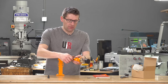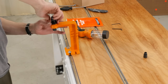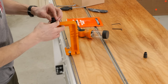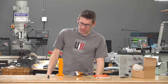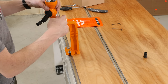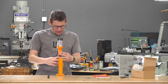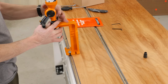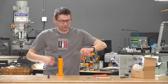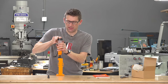I'm loving that. We just take this die out — looks like we can leave the funnel on, which is cool. I'm going to crank it down so I have a bit protruding, a little more clearance, then hand-tighten the lock ring. We put the powder measure on and rotate it so that it gets into one of the detents — there are little detents radially arranged around the die body. I'm going to mount it so it's perfectly straight in one of those detents. Now when I want to empty the powder, I just loosen the screw, take off the cap, empty the powder, put the body back on, wiggle it a little so the screw goes into the detent, and there we go.